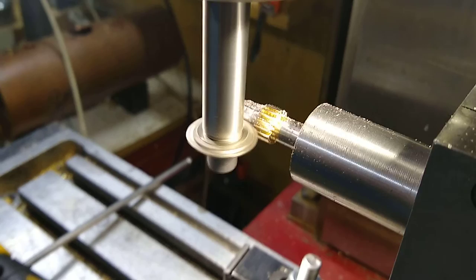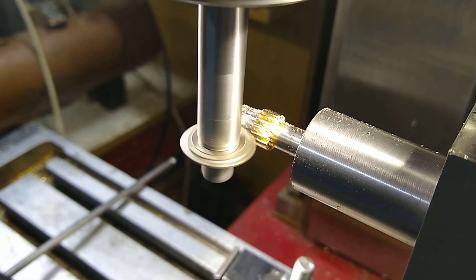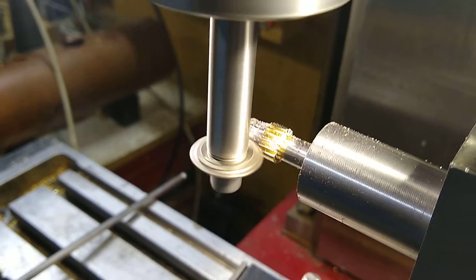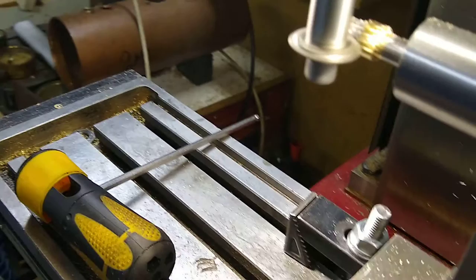This is a video showing the cutting of a 16-tooth pinion for the wheels required to set the hands, running at 60 times the hour hand. It's the last wheel to be cut on the clock, one I'd overlooked actually, and I've just finished a cut.